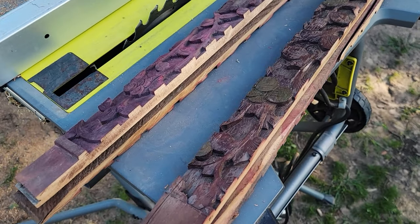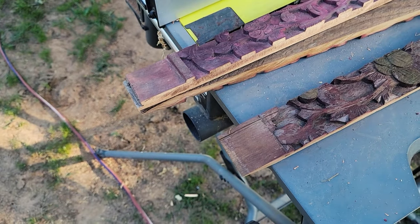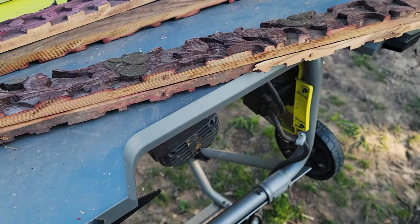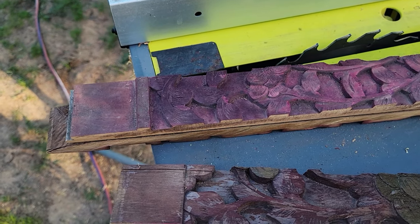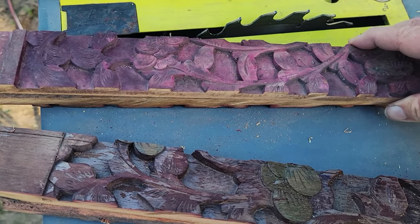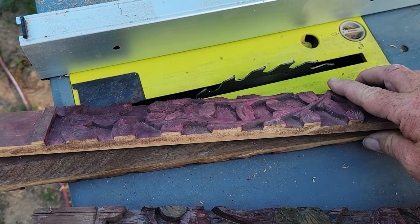I ended up with these two-inch strips that aren't usable in their current form. What I'm going to do is use those as backer boards to make a thicker board — so when I put it up and prop up the drywall, I have a bigger footprint. The drywall is screwed and anchored to the joist in the ceiling, but thicker would be better. I'll get my nail gun and some glue, glue those up and nail them, then cut them all into usable components to put up above that window.